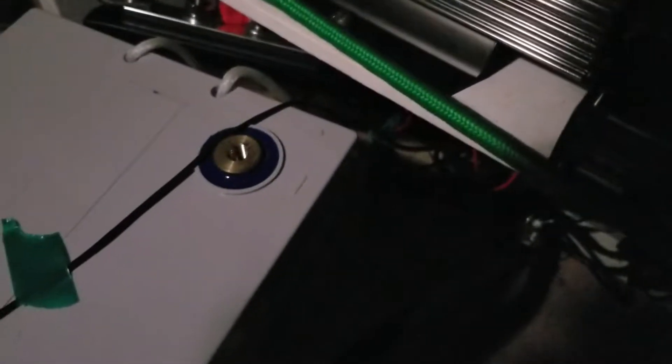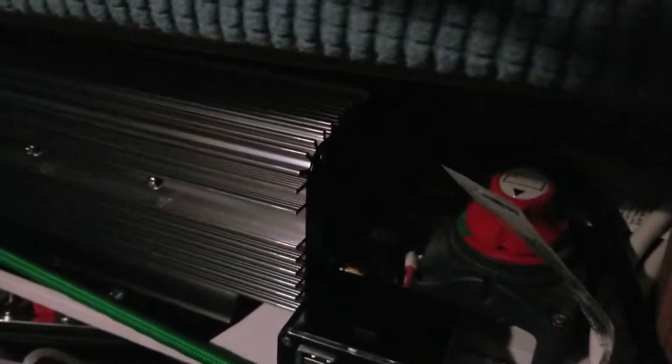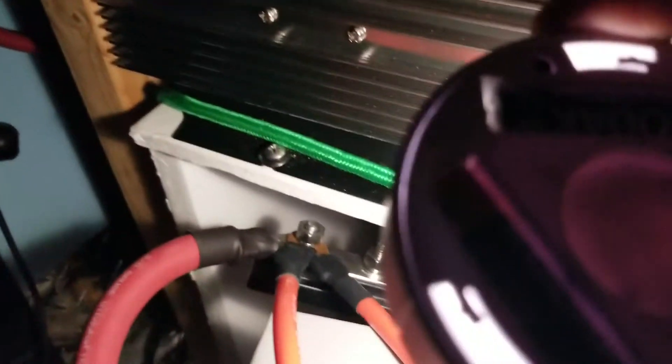Here I am in the dark. I'm taking this one off and hooking up the dual cables right there. I made sure I took the negative off first — always do your negative. Make sure to turn all your power off too; my disconnect switch is off. You don't want to blow anything up. I'm using one of my tap lights right here, which is really nice. If you have a cargo trailer or RV, battery-powered tap lights come in handy for emergencies.